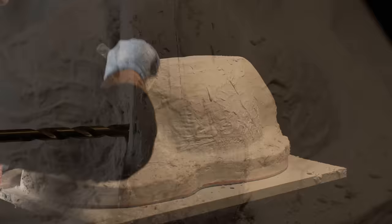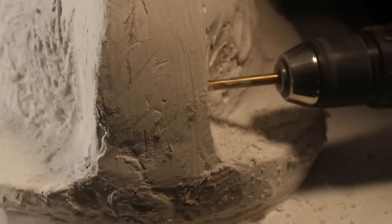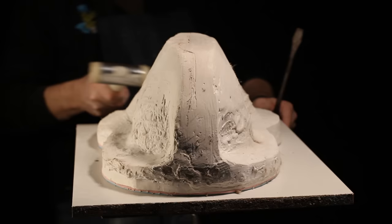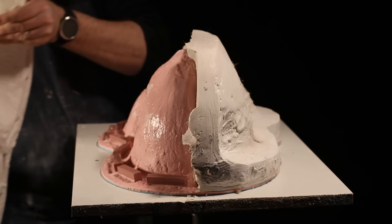Now all the plastering is done I just need to drill in a couple of holes because I want to use bolts to hold this mold together — just two long bolts, one at the top and one at the bottom. I drill carefully using a drill bit — fresh plaster with scrim still has a lot of moisture so it may be tricky; a masonry drill bit would work well too. Then I separate the two halves using a screwdriver to carefully pry them apart, and with a little careful prying the two separate nicely.